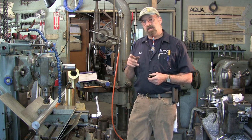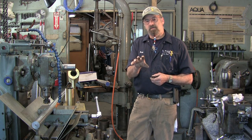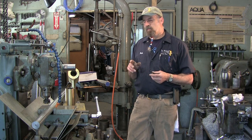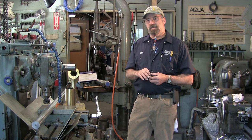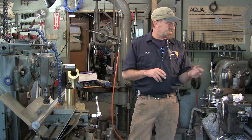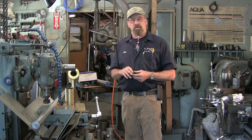It does help more than having a round bar. Sometimes a round bar will actually just kind of spin inside a spool or a hub of chips that stay stuck in a bore, but most of the time with the flat, you end up kicking them out somehow or another. It works a lot better. If you can get the chip to really break, it's kind of nice because you got a little bit of an air gap in there, and sometimes you can look down through the tube with a mirror or whatever. Not all the time can you get your head down next to your bar and sight down your bar while it's cutting, but you can stick a mirror there and look at it.